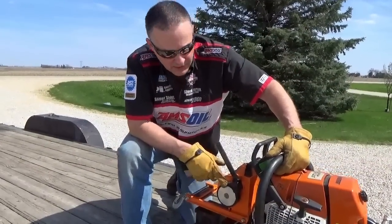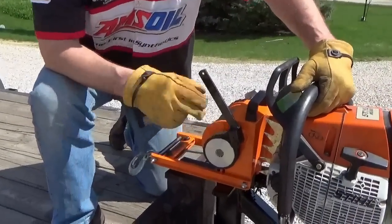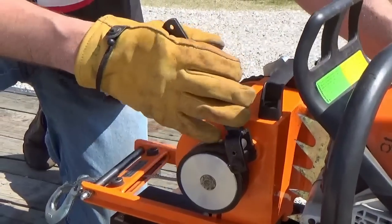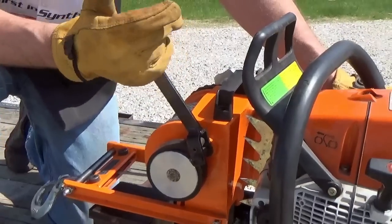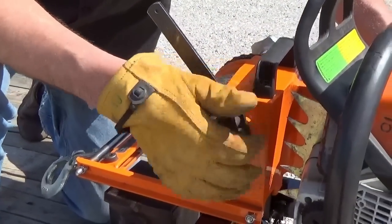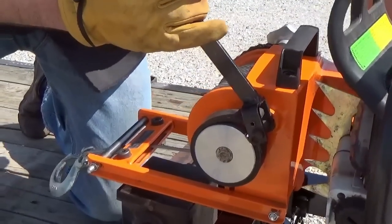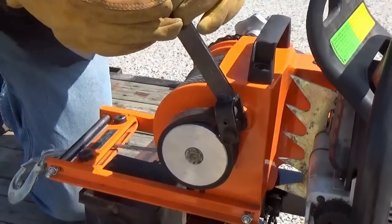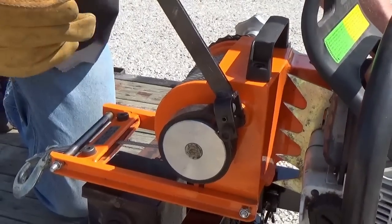Okay, on the handbrake on this winch, some people use a bungee strap tied back to the rear here to keep pressure on it all the time. But what I've done is I took the bolt out here and I put some Loctite on it and also on the set screw for the bolt. And I've got it to the point where wherever you move it, it stays. So I don't use a bungee cord. Some people do. You can do however you wish with that.